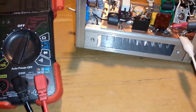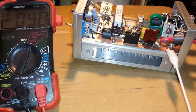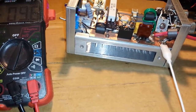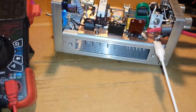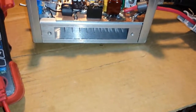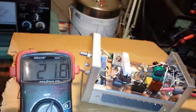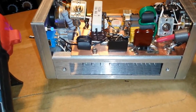Some people over-bias and run the pill hot and blow the pill pretty quickly. It's all about idling that current — when you're AB biased, you're not only giving it the particular voltage it needs to turn that transistor just before conducting, you're also doing some current limiting to give it just that 100 milliamps for that transistor. So you're doing two things at once. I've been running AB bias on 2879 boxes for about four years now, running the heck out of it, and it's looking good on the spectrum analyzers.